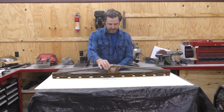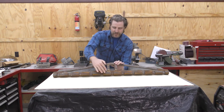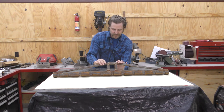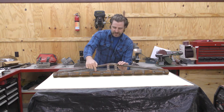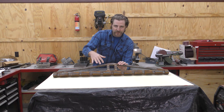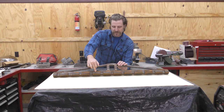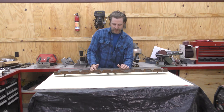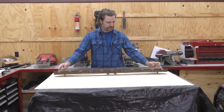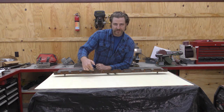It's a really straightforward project — just a couple different types of metal. We have the bar, multiple cleats, the support straps, plus the hook and tie right here. All this is one by two rectangular tube, and all this metal is an eighth of an inch thick. Then I went through and got angle iron that's one and a half inch and welded it all along the bottom, making sure that my spacing for my horizontal wire is perfectly within the center, which is nice. I welded it to the bottom on all three sides of the square tube.